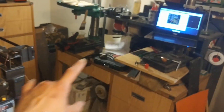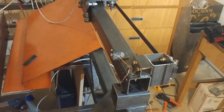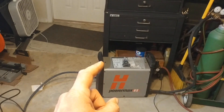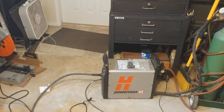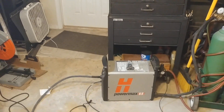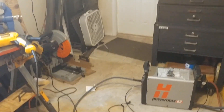The Wi-Fi is working, which is great. I also have not had any problems with the wires here for the home switches, or any false triggering. Granted, I am running a Hypertherm plasma torch which does not use a high-frequency start — it uses a spring-loaded electrode, and that supposedly puts out less interference than models that do have a high-frequency start. So your mileage may vary, but for me it's working, and hopefully it stays that way.